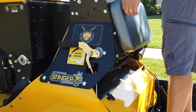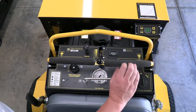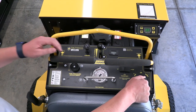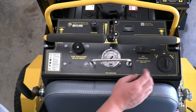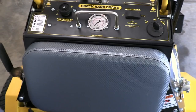Always set the parking brake when you leave the machine, even for just a moment. To start the unit, set the throttle at 50% and pull the choke. Once the unit has started, disengage the choke. After operating the unit, throttle all the way down before shutting off — this can be accomplished with the key switch. Turning the key to the left will turn the unit off.